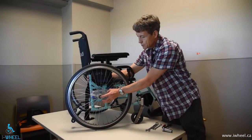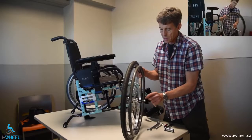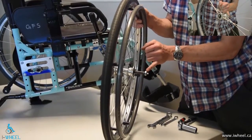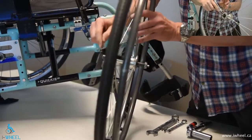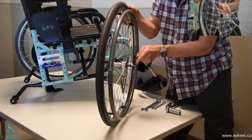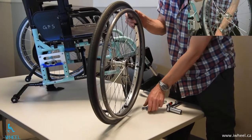If you need to adjust the rear axle, you take it off and you'll see that on the plunger side — the quick release side — there are threads and a 3/4 inch nut. On the other side there's sometimes a flat spot, but you'll see the balls. These threads allow us to adjust that nut in and out. If we move it in, it shortens this distance and reduces the amount of play that we have.